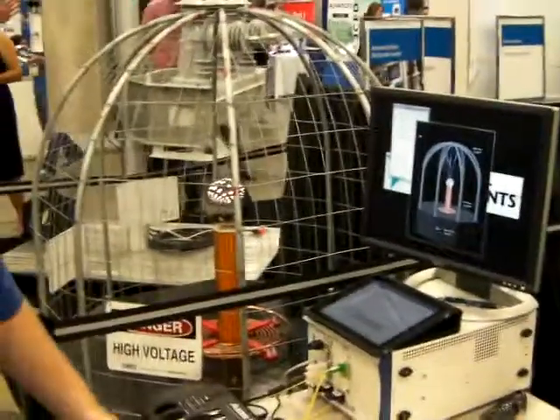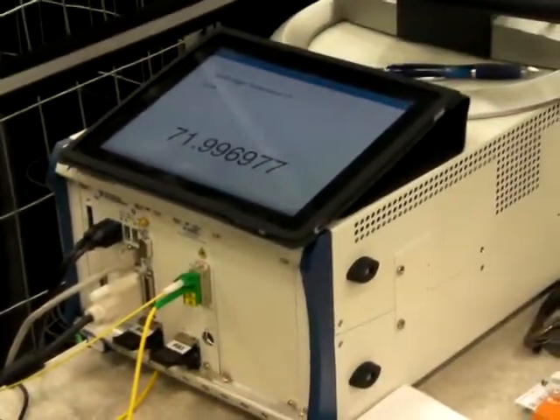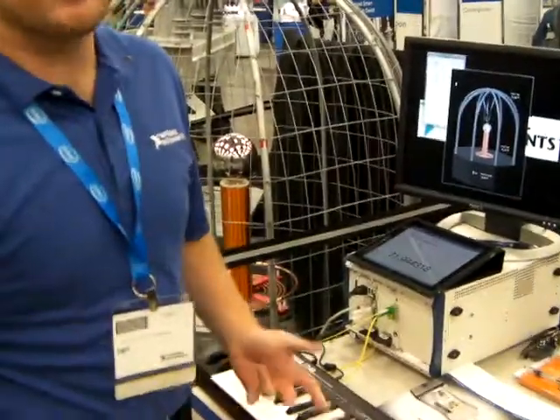I would like to talk to you about the PXIE 4844. It's an optical sensor interrogator — a four-channel optical sensing device that uses optical measurement. We're using fiber Bragg grating sensors in here, not a traditional thermocouple that would get completely roasted with all this electromagnetic interference. Fiber is electrically passive, so it's great for any hazardous application with a ton of EMI.